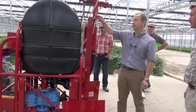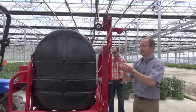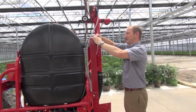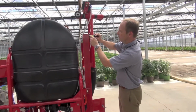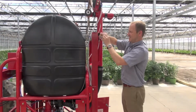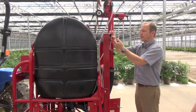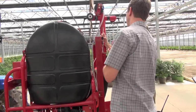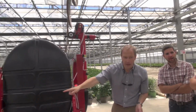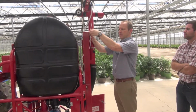Screens in the anti-drip? Yeah, there's filters inside here. They're just small, you guys have seen these before. Can you open it? There's solution in here or no? No, we opened them, unless they got pressurized. That's the check valve right here. That's a Viton seal on that end. And your filter is right here. You guys probably even have these sitting around from TJ parts. We've got them in stock, but you guys ran down and got the pins for this thing at the tractor dealer down the road. They've probably got this too. The check valve, it's all the same stuff.